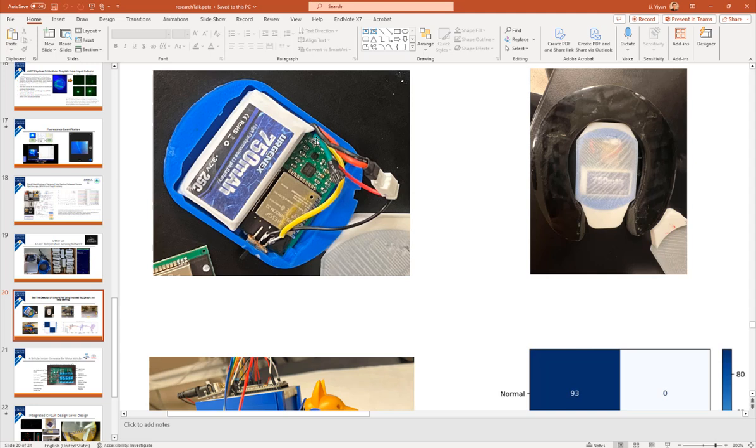And there's a charging board you can connect to it. I think we are going to do that for Lab 14 as well. So it's a really good lab. It's charging up the battery at the same time, powering up the chip or the system. It's a different charging circuit, but the one I use has battery in and eventually voltage out. So whenever you connect the power source to the charging chip, it's going to charge up the battery, but not interrupting the power supply.